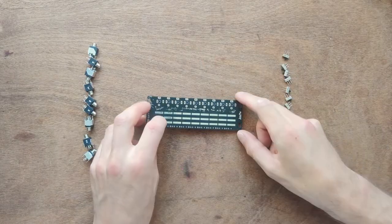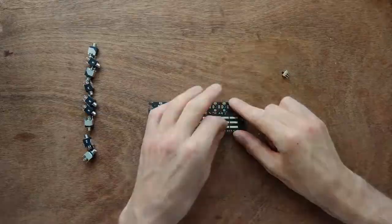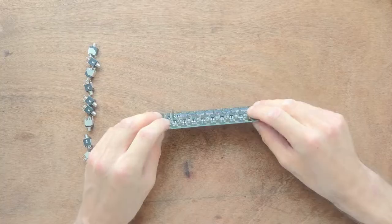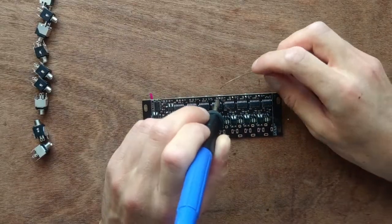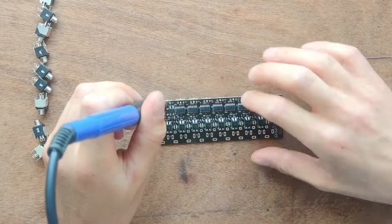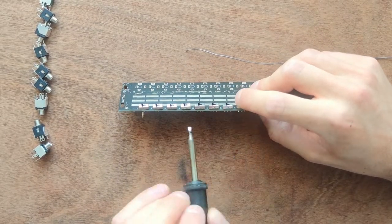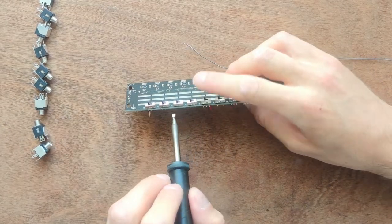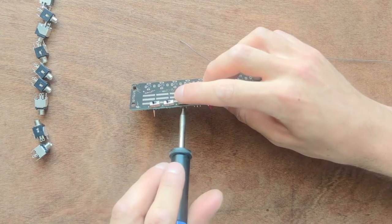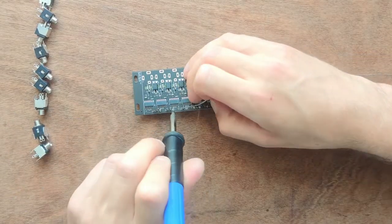First, place all the switches. Gently roll the PCB over and tack one leg in the middle of each switch. This allows you to ensure that they are flush with the front panel. Touch up your work, ensuring the switches are flush. Then solder all remaining legs.